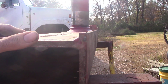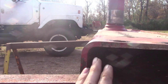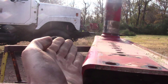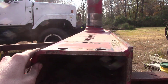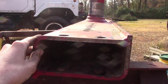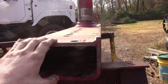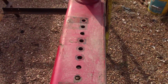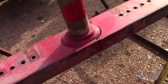I don't know if y'all can tell, but she's pretty good and bent. You can see it's a good bit offset right there. You can see the bow here. If you're looking at it, this is the top of the axle - if it was laid over 90 degrees this way, this would be where all your weight bearing was going. I think they actually have a recall on some of these because they were breaking. If you put grain extenders on the combine, it can't handle that kind of weight, especially trying to jump a ditch.